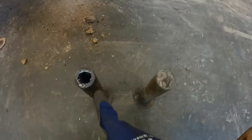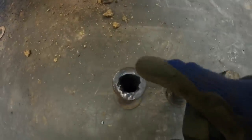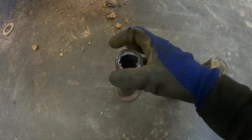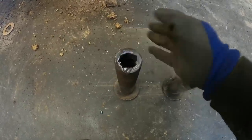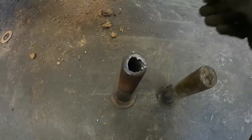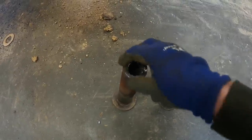All right, guys, a little bit of show and tell time. This is the pin that Aaron lanced out. See the big hole he blew all the way through it? This is the pin. We didn't have to do that. The reason why that works is that you blow that hole out, and whenever it cools, it shrinks in on itself and loosens, which makes the diameter of that pin just small enough that it'll go through there. And of course, the heat don't hurt anything anymore.